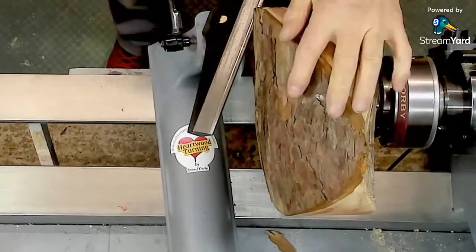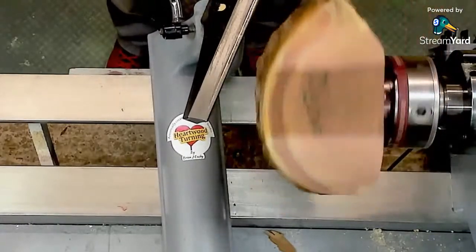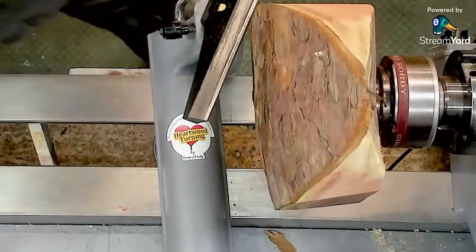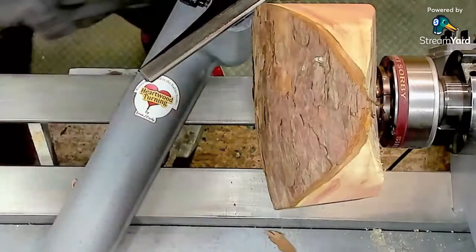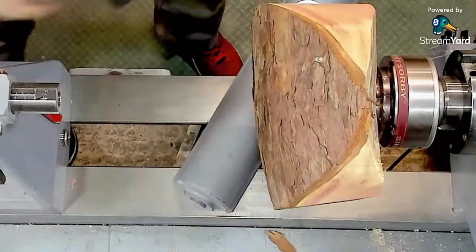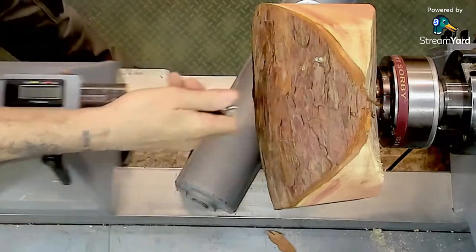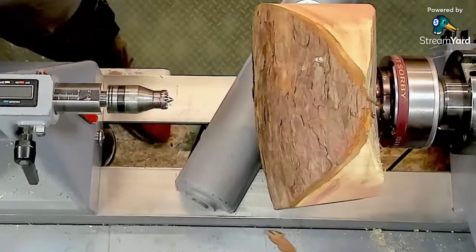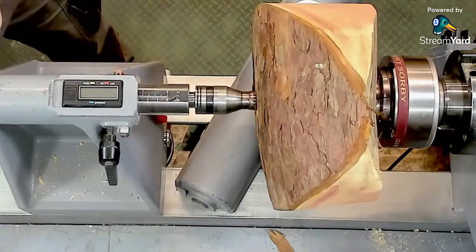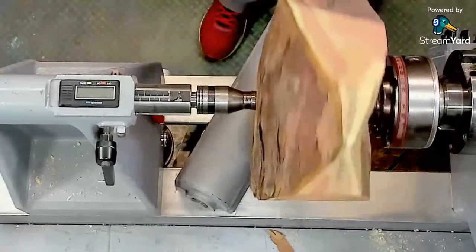Is this like our version of the cedar wood? It's actually similar to cedar wood. Cedar tends to have a lot of oils and wax inside in the wood. I'm just going to bring a tailstock up just to begin with, just till I get started. We'll put a step center on it. And that'll allow me to get the bark and stuff off.